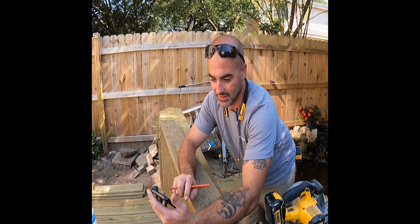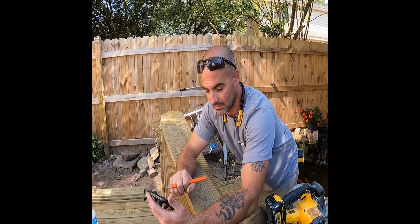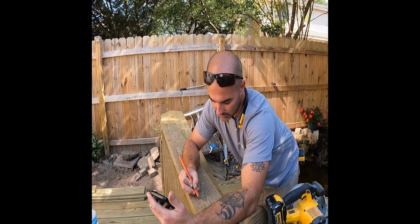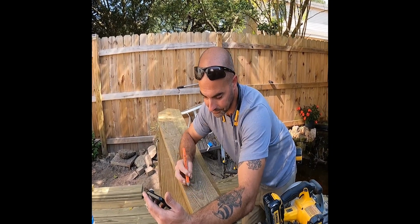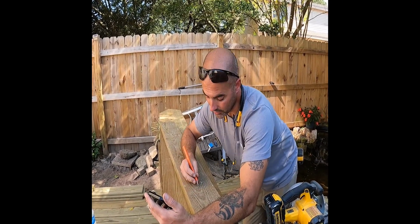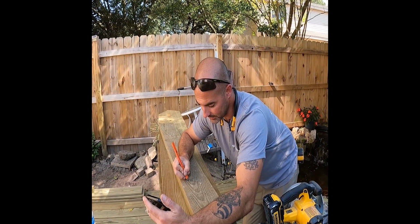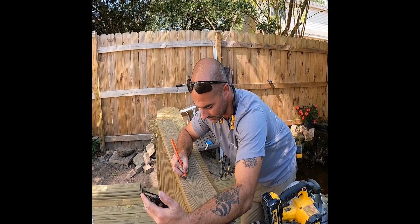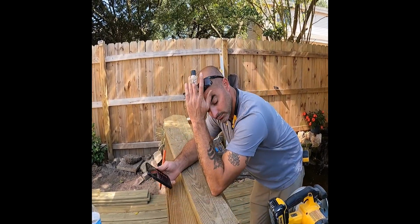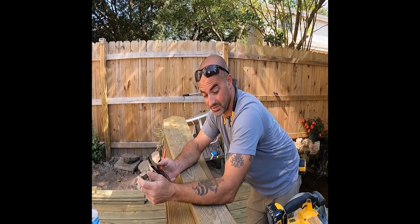And now we're going to take that 16 and take the 114 inches, our total height, divide that by 16, and we have 7.125. So 0.25 is a quarter, so that's 7 and an 1/8. So your rise height for each step is going to be 7 and an 1/8 of an inch. Okay, the 7.125, 7 and an 1/8. So now we know how high each step is, and we know how many steps we need, which is 16.